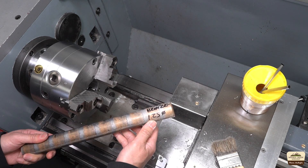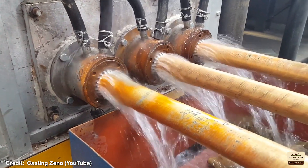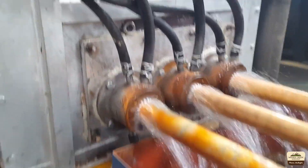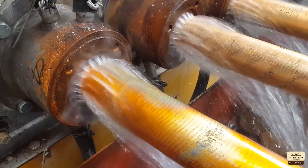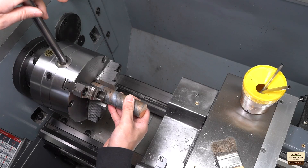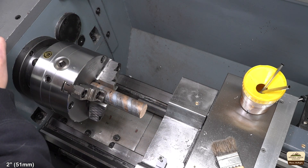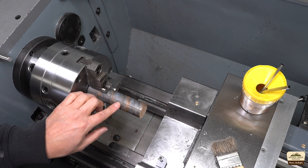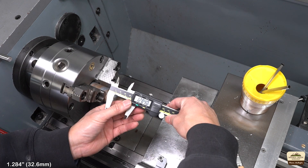The nut will be made out of 932 bronze. It is a popular choice for this application because it is resistant to wear, impact, and easy to machine. The unique finish you see comes from the continuous casting process used to extrude the material at the factory. The finish length will be two inches, and even though it is sold as a one-and-a-quarter inch diameter, the actual size is big enough so you can clean up the mill scale and still end up with the stated diameter you need.